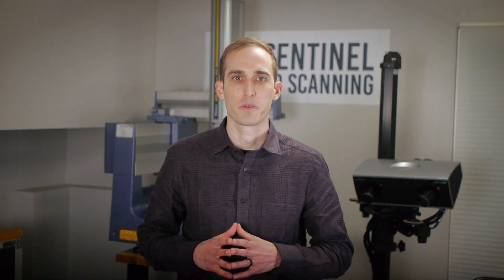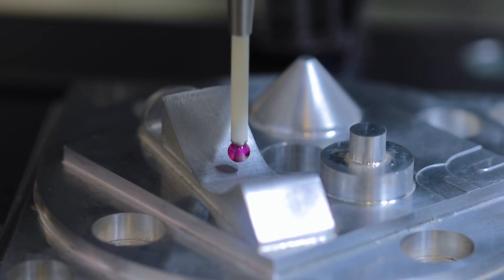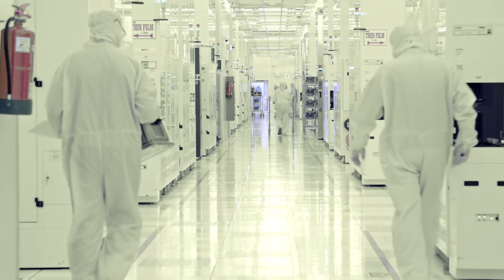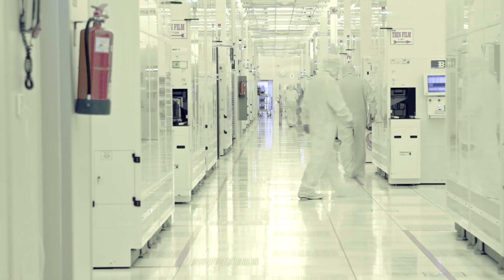While we're on the topic of air, let's discuss cleanliness. It's important to keep your metrology lab space clean so that measurements can be as accurate as possible. Dust or foreign material on your parts can cause a mis-measurement, especially when using non-contact methods like vision systems. Foreign material on your measurement equipment — think particles on a CMM stylus — can also cause incorrect measurements. In extreme cases, you may want to consider making your lab a clean room. There are different clean room classifications specified by ISO standards, though clean rooms will also make your life more inconvenient, such as requiring you to gown up prior to entering.